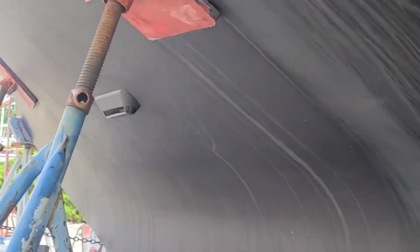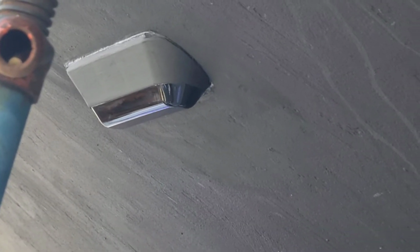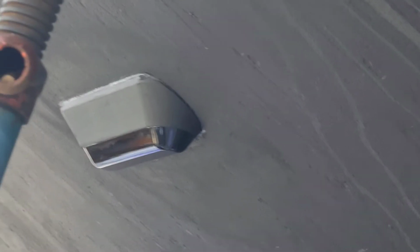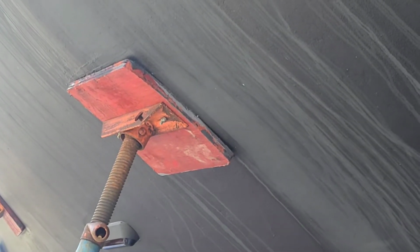Morning. Right off the bat I painted the side scan sonar transducers. There's one on each side. So we bottom paint that, and then when we put it on the belts, we're going to scrape and paint those sections where the stands were.